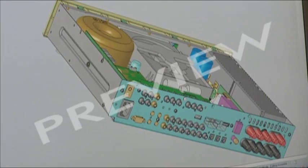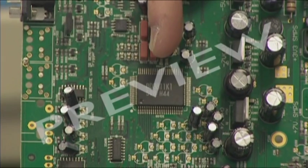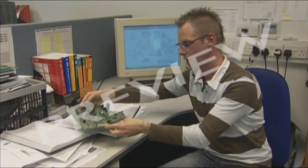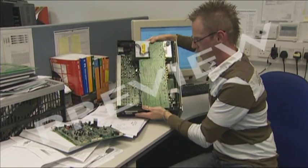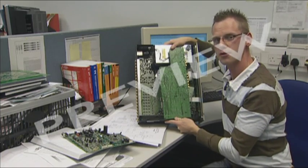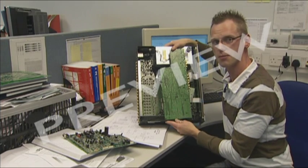It's a big challenge just to get everything in, and compromises have to be made. One of the biggest compromises was to miniaturise parts down. Here we have an integrated part, which is a stereo switching device and volume control, all in one small tight package. That can be compared with one of our flagship products, the AV9, where the entire section on this bottom board does roughly the same sort of thing. You can see there's a massive difference in size. In a product like Solo Movie, there is no room for this kind of arrangement — we have to go to an integrated product, just to be able to fit it within the circuit board itself.